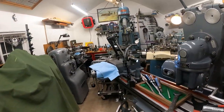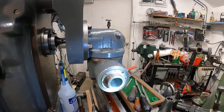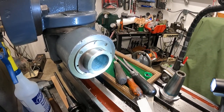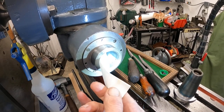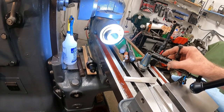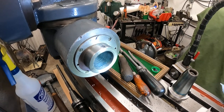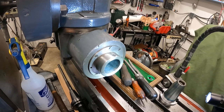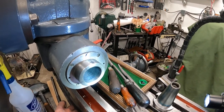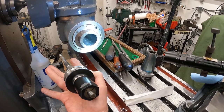What I've got going here is a spindle that's not running true — it's been chewed up a little bit. I had three and a half thousandths runout and I've got it down to two thousandths. I've got my most accurate collet chuck right here; I tested it and it's probably a quarter of a thousandth running true.